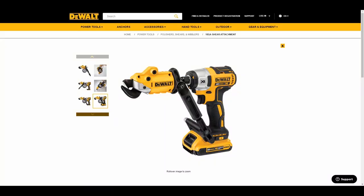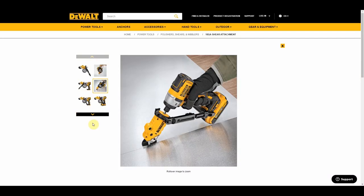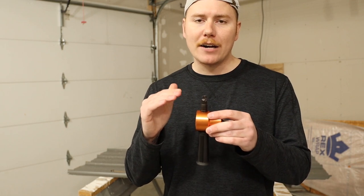Understanding why you'd want this over a shear or a double-headed shear is really important. I'm going to be using my DeWalt impact driver — DeWalt does make a nice shear attachment for roughly $50, sometimes on sale for $35–$40. The reason you might want a nibbler is it works really well when you have to go over something like corrugated siding when making a cross cut. A single-headed shear is basically a motorized pair of metal snips. A double-headed shear has two blades performing the same action, but a little pigtail curls up in the metal as it cuts.